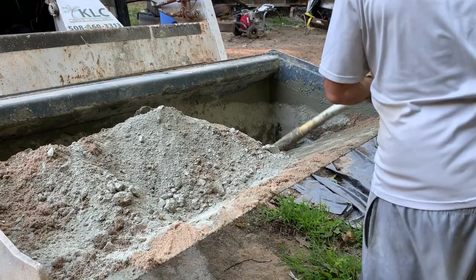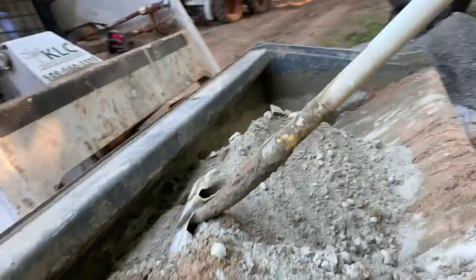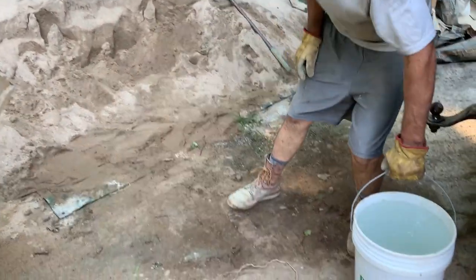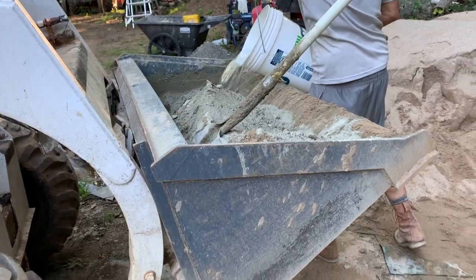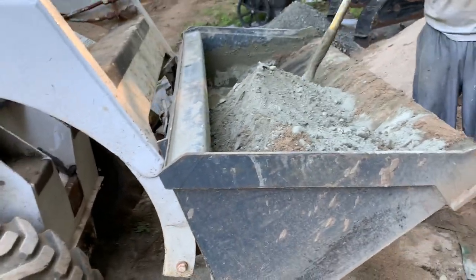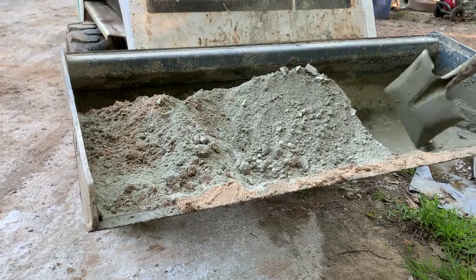from this scenario. Now another thing is that obviously it's easier to mix cement when it's a little wetter. And one thing that's a note is yesterday morning when I started this project, the sand was wet, or wetter, because it had rained the night before. Well, I noticed during the day yesterday that the sand, I needed more water. Now, even if you're gonna go with buckets, which you see I'm doing, I've got 5 gallons. I had to adjust my ratio yesterday a little bit because it was drier later in the day. Because obviously the sand and my aggregate was drying out a little bit.